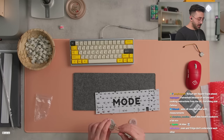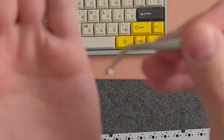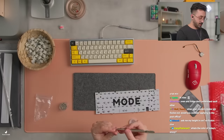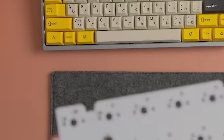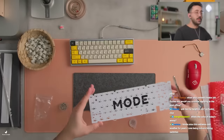So basically all I'm doing, guys, is I'm sticking these really, really small sockets. Actually, I kind of prefer these over Hotswap sockets, the Milmax. We're sticking these in every single switch pin area where we'd normally find them. So you guys can kind of see it right there. And then we're gonna solder them into place.